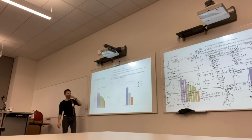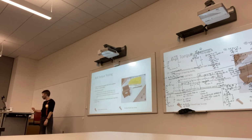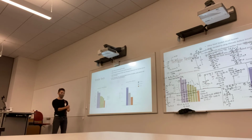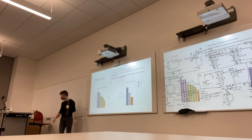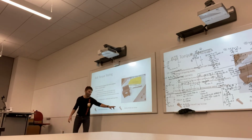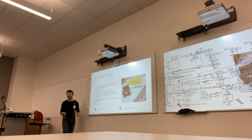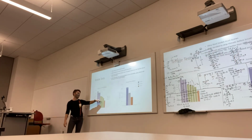What we found is that the socket head, which, just to remind you, looks like this guy down here, tended to be able to survive the highest forces without actually breaking their threads, at least when they had a nut at the end of them. They were able to stand about 1,000 megapascals of force. It took a few trials, and that was about the range they could do. From there, as you reduced to lower profile bolts, you started to see the bolts strip at earlier forces. Instead of 1,000, we're revolving around 750 going to the nuts.